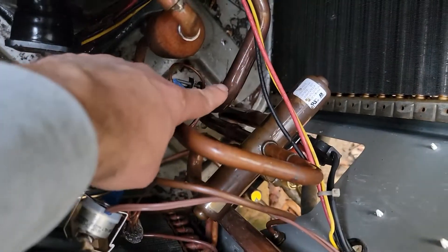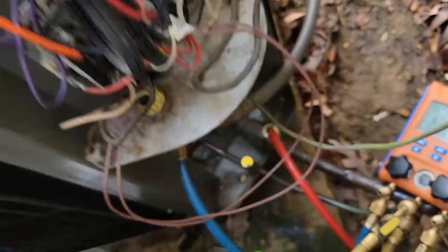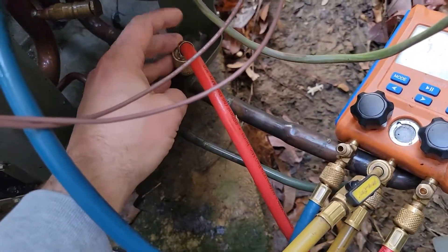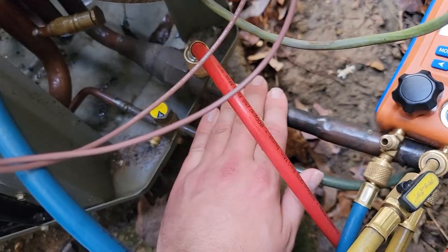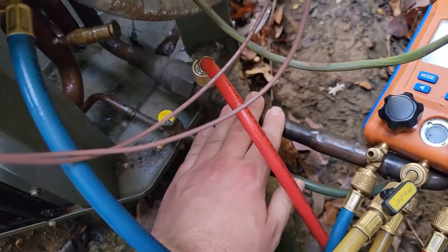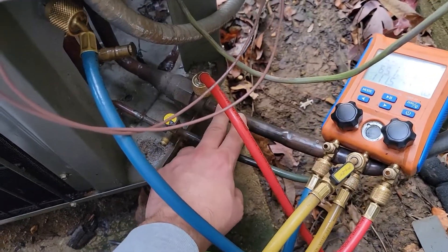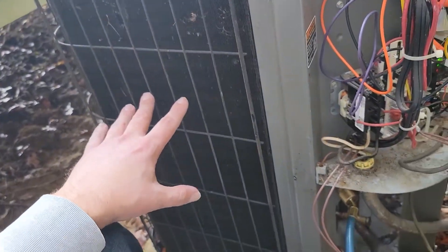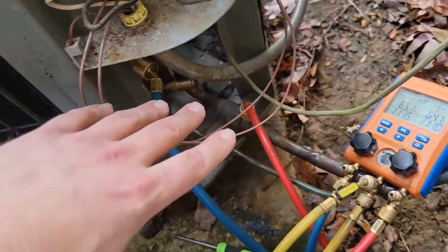This goes to this tube, which goes over here and then goes to the suction line that goes to the compressor. So we're going to be measuring the pressure of that suction line, and then our high side hose is hooked on to the hot gas or vapor line. During the cooling mode, this line is cool, and during the heating mode, this line is super hot because we're sending superheated hot gas vapor into our indoor coil, which is no longer the evaporator — it's the condenser. And the outdoor coil becomes the evaporator. So indoor coil becomes the condenser, outdoor coil becomes the evaporator during heating mode.